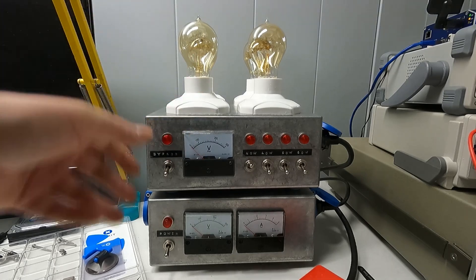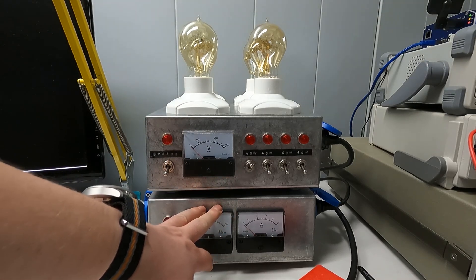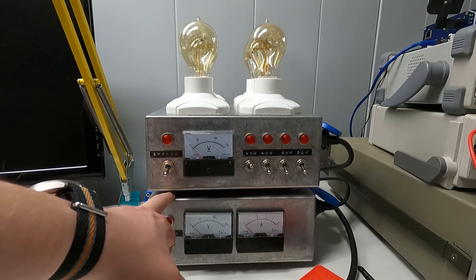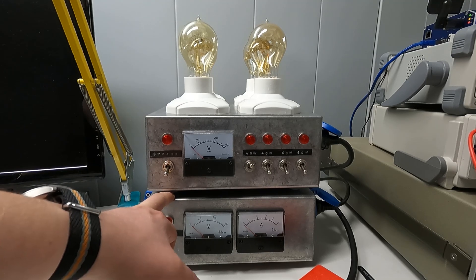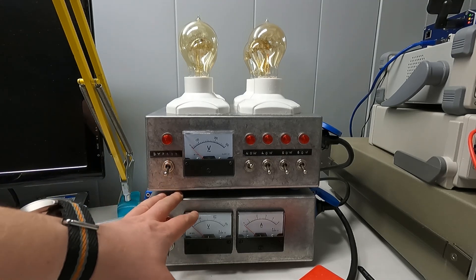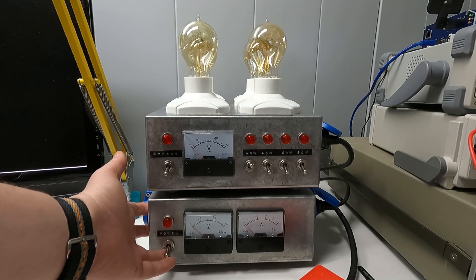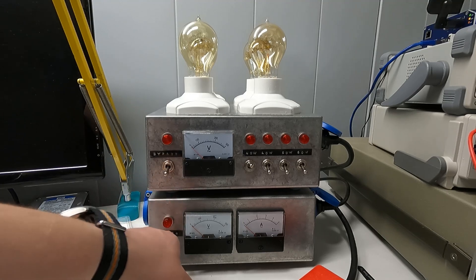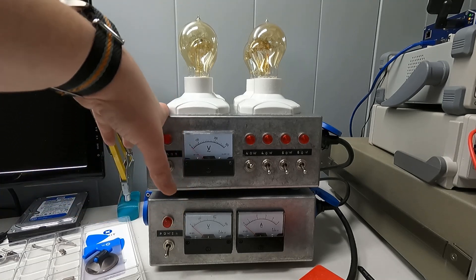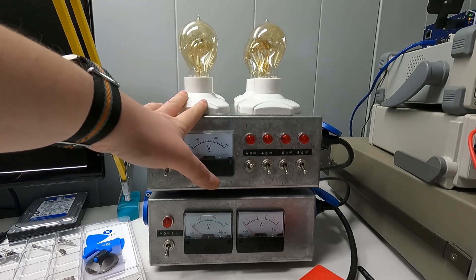What this is is an isolation transformer in this bottom box. These are Hammond cases — Hammond 1550N if I remember correctly. The bottom one has an isolation transformer: a large 500-watt toroid transformer that weighs several kilos. On top sits another box which doesn't contain a transformer.